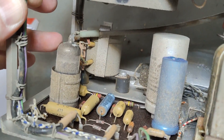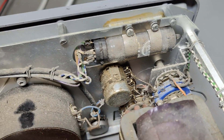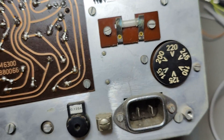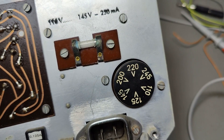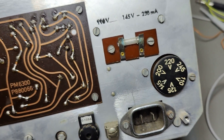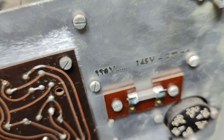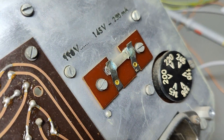Exactly like I said - one dual triode, and that is the indicator tube. Absolutely lovely - I love these phosphor glowing indicator tubes. It even says here ECC83, and that is the type number. BM6300. We could probably adjust the mains voltage - we are at 230 something at the moment, so maybe it's better to go to 245. I think what I will do is measure the filament voltage and aim for the correct voltage. That is one absolutely crappy fuse holder - probably the most lame I have seen in a long time.